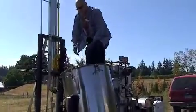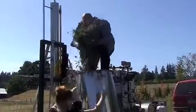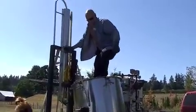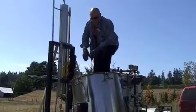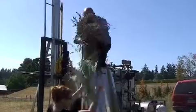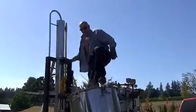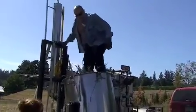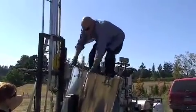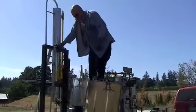Under normal conditions I could probably make about two and a half pounds of oil per batch from this particular plant. And can you tell us about what happens if there are gaps in the plant material — if it's not packed? Well, if it's not packed, you get rat holes where the steam follows the path of least resistance. If you have a rat hole or a big space for the steam to go through, that's where it's going to go, and you won't get adequate coverage with the rest of your plants.